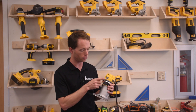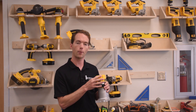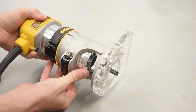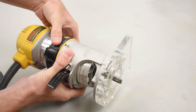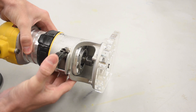It's only got a couple of controls: the on/off switch up front and your speed control knob. I recommend you start with one and work your way up until you can see what works best. Changing the depth requires you to unlock this collar here and then rotate the DeWalt-logoed ring, which will go up and down the grooves and change the depth of your router bit.